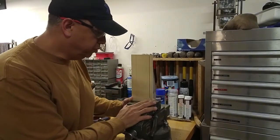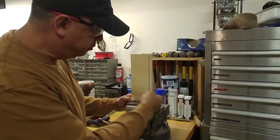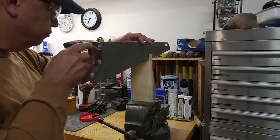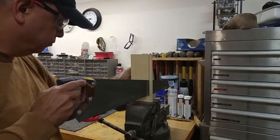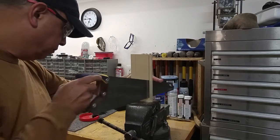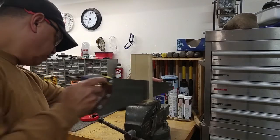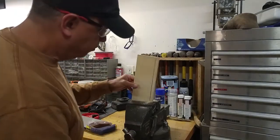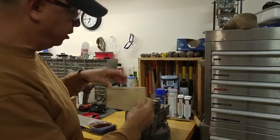The next thing — put the board in the vise and I'm going to trim out the part that I didn't cut off with the table saw. And because I marked the line, I know how far to cut down.